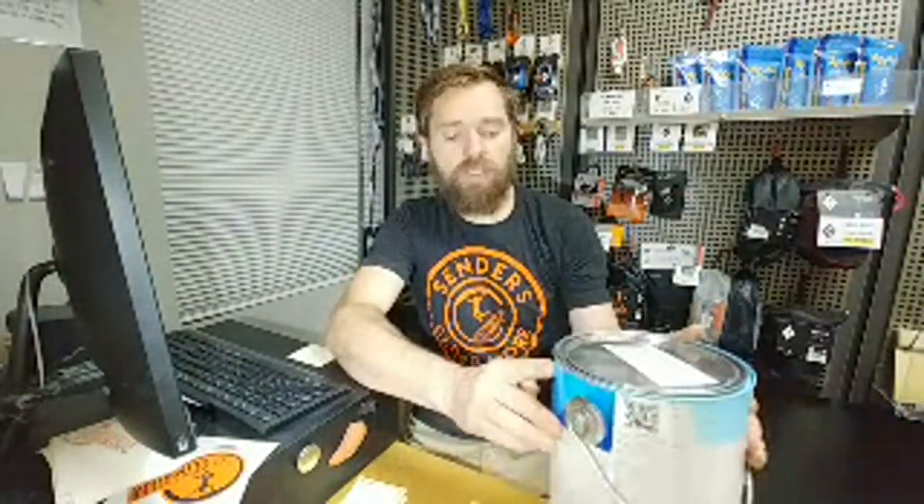With this paint being super runny, I may have some bigger issues. If I do, what I'll do is first try to run a bolt through the t-nut from the back side. If paint gets into the threads, I'll try to push it out — might use a tap to cut it out. I've never been in that situation before so I'm not sure exactly what will work best, but those are the steps I would try.